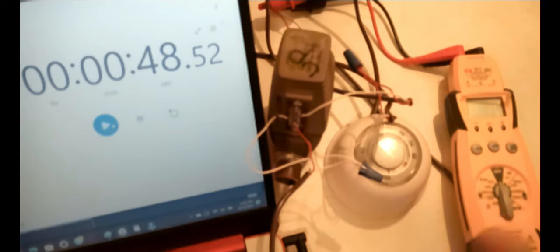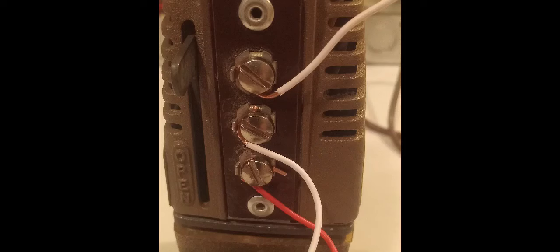If these things are a lot colder, it can take even longer than that. You do need patience when you're trying to diagnose these things — it takes a little time. So if you waited long enough for your power head to heat up and you're still not getting continuity between terminals two and three, that can be an indication that there may be something wrong with your end switch.